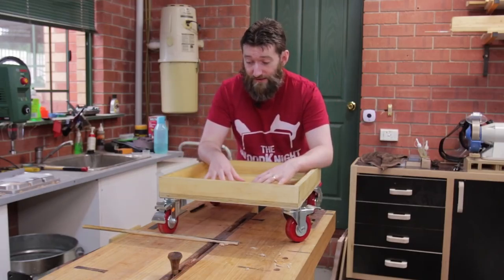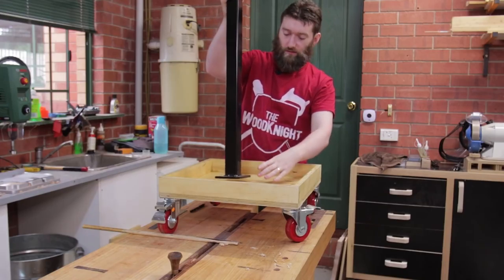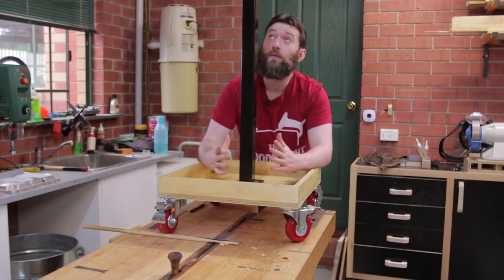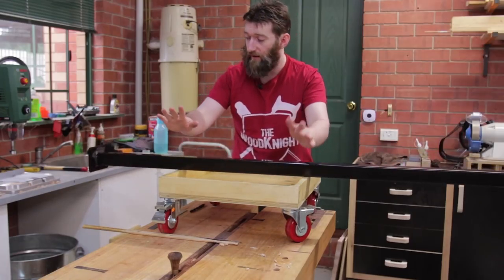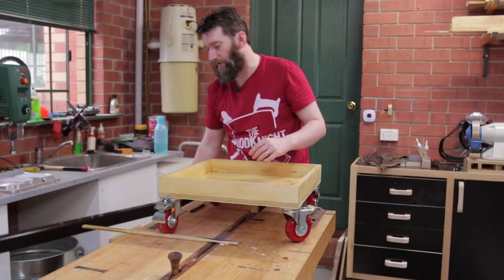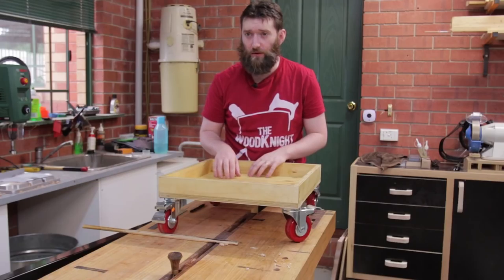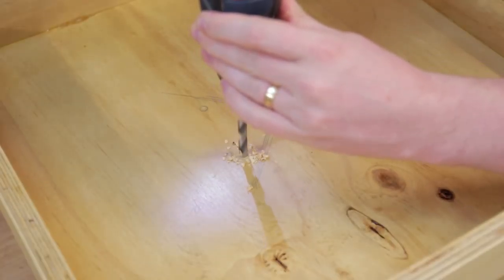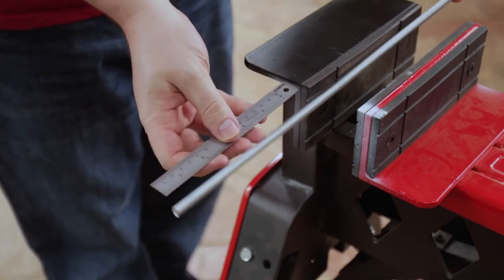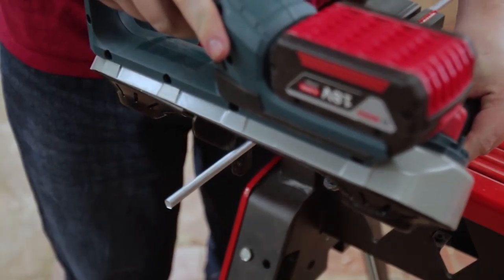I'm not going to concrete in the post itself. I'm going to use this aluminium fence post. These are not super expensive, not super cheap, but there are a few reasons: it's tall enough, it's readily available from Bunnings, it's got a flange on it, and it's black so it's already pre-coated so I don't have to paint it. The flange has 12mm holes, it might be 10mm holes. So I'm going to get some galvanised threaded rod, cut that up, bolt that through the plywood and then silicon that in, then pour the concrete. Then I'll be able to screw this onto those threaded rods sticking out of the concrete and it'll be very secure.